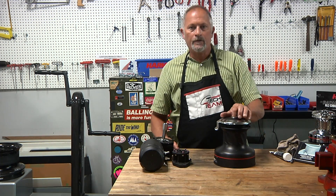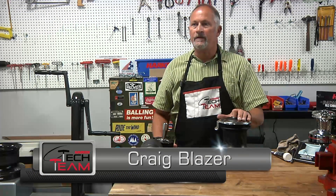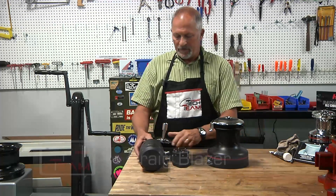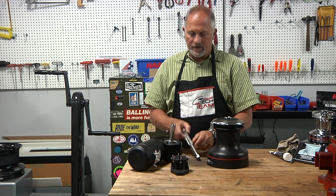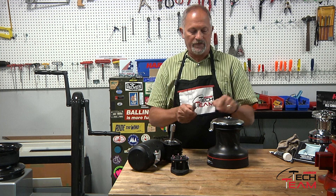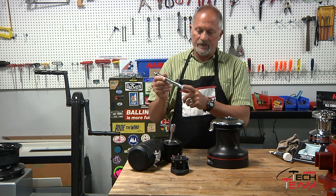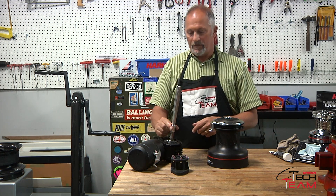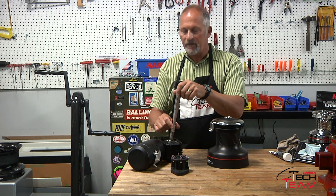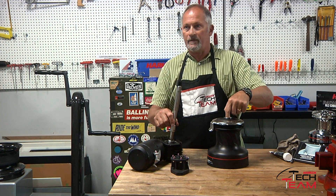We get asked a lot: how do I electrify my Harken winch? Is it possible? What parts do I need? It's very easy with the radial winches to convert to electric. You can see here these are basically the parts you'll add. This is the center shaft which is replaced on your winch — an extended version that connects to the drive shaft coming out of the gearbox. It's on a spring-loaded clutch so you can disconnect it with a disconnect rod when you put a locking handle in.